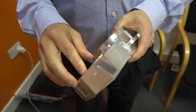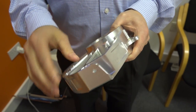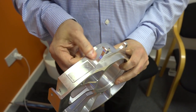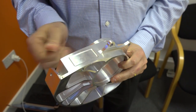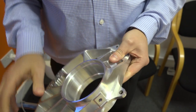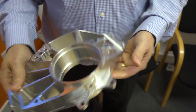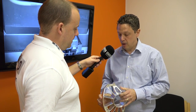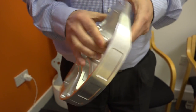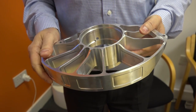What's going to be on everyone's lips is: how quick? It's 20 minutes from start to finish. 20 minutes from a 400-millimeter diameter billet — have you any idea how much material you're removing? There is a lot. It was really about just getting the part off as quickly as possible. In terms of speeds and feeds: this is actually not the top of their range, it's a mid-range machine tool, so the RPM is roughly about 10,000.